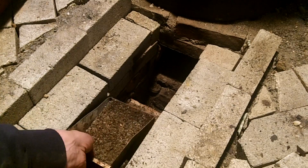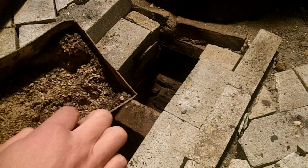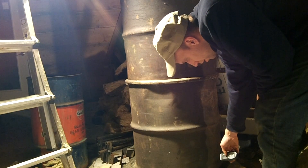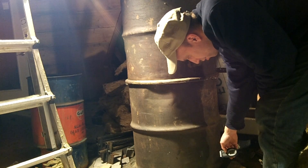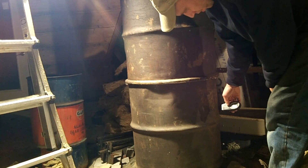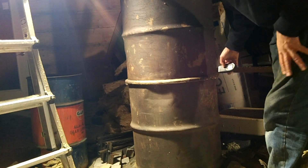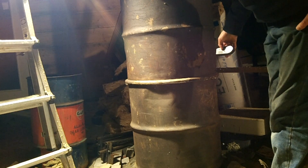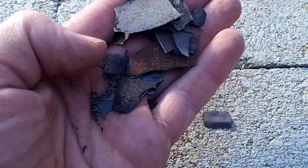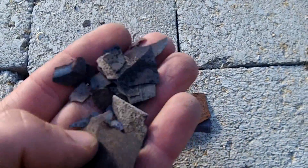This tray is holding ash from a 40 pound bag of pellets. The stove burns hotter with the pellets than any of the wood I used in it last year. My IR thermometer reads the barrel temperature to be 500 degrees Fahrenheit halfway up and around 300 near the base. With the wood, it maxed out at 500 near the top. It's burning around 8 pounds an hour, which is roughly 64,000 BTUs per hour. One problem I'm finding is that the center chimney is falling apart, but I'll deal with that in another video.